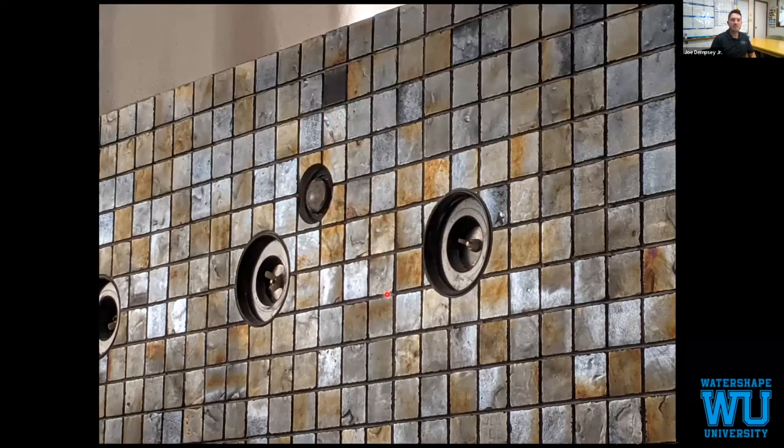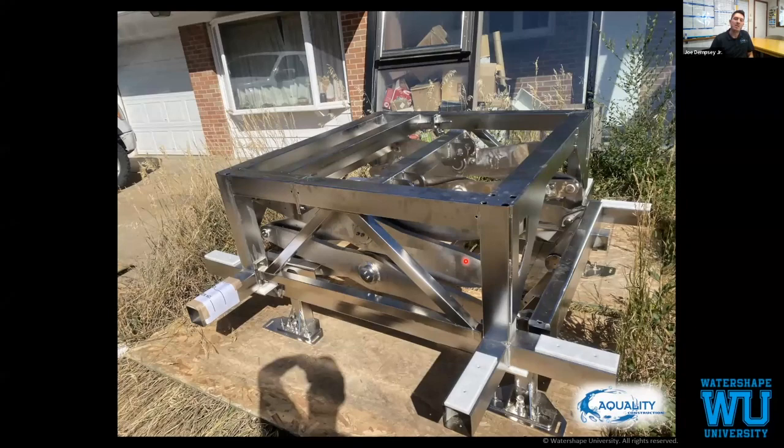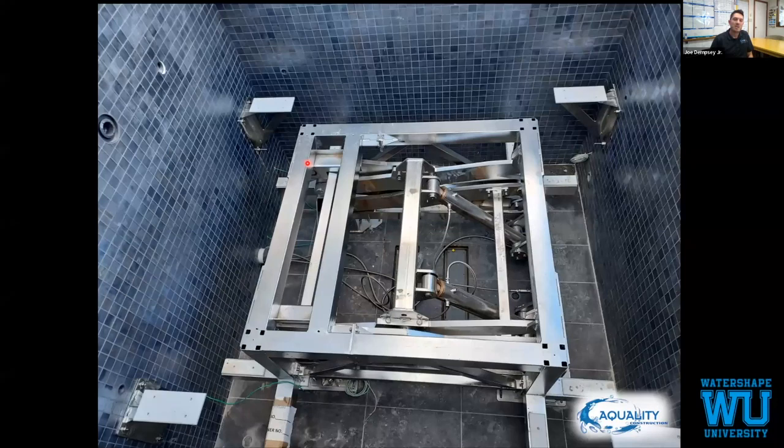Twinscape shows up. This is the spa system, scissor lift, craning it into place. It's now in the spa. The way it works basically is as the spa floor drops, the benches land on top of these brackets and then rest on top of those brackets. Once the scissor lift floor system lifts up again, these L brackets, once they get to the benches, they pick up the benches and then lift them up with the floor system.